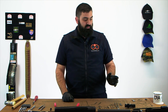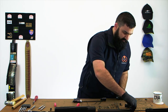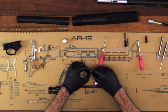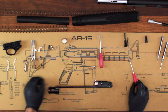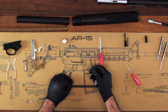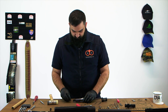The next thing to do is to reassemble the bolt. I'm going to do both the bolt and the ejector in this segment because they're both fairly short and easy things to do. All we removed from the bolt last time was the firing pin. There are four components that you should have on your table: an O-ring, the firing pin retaining pin, the actual firing pin itself, and the firing pin spring. This O-ring needs to go onto the firing pin before the spring — it's a little buffer. Then the firing pin spring. Ensuring that the cam pin is orientated correctly, you can insert the firing pin in from the rear of the bolt.